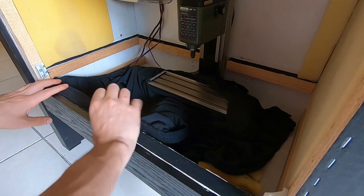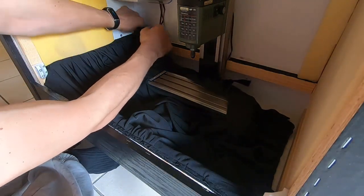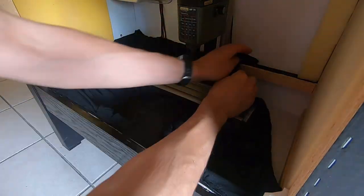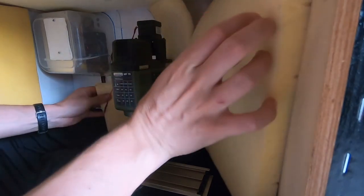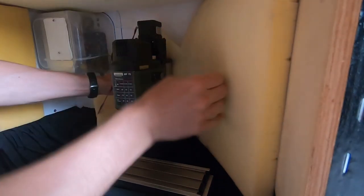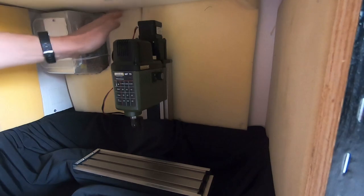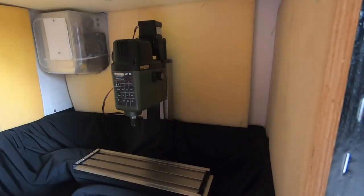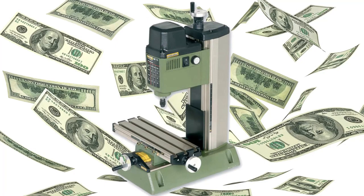The textile protection is fixed to a wooden frame using velcro tape. One side was sewn to the fabric and the other side was glued to the frame. This allows for easy removal when necessary. For the final step, I covered the interior of the case with foam in an effort to absorb as much of the noise while it's still inside, before it goes outside and ruins my neighbor's napping. I went the cheap and dirty way and used the foam from an old mattress. If you want a more elegant solution, you can buy some of these dedicated acoustic panels, if you feel you haven't spent enough money on this thing already.